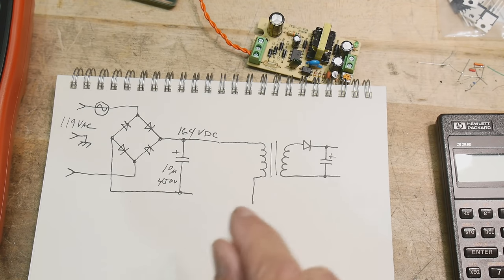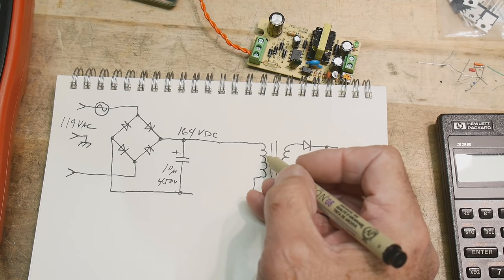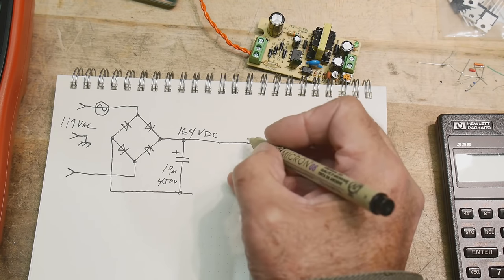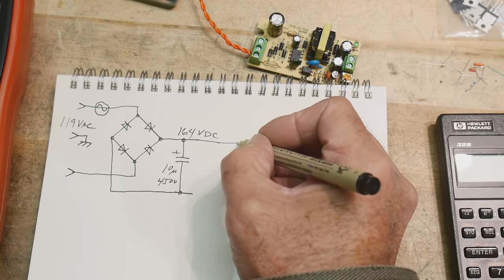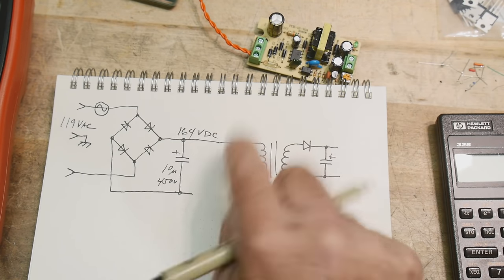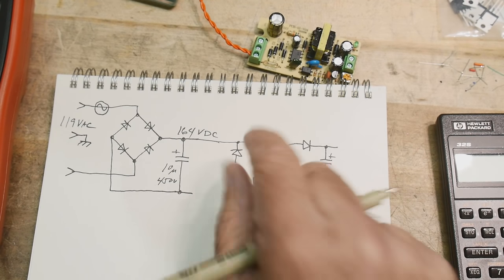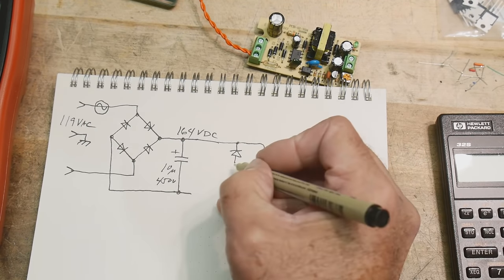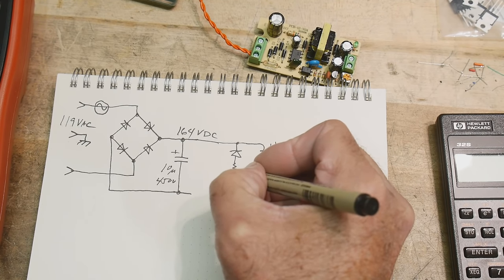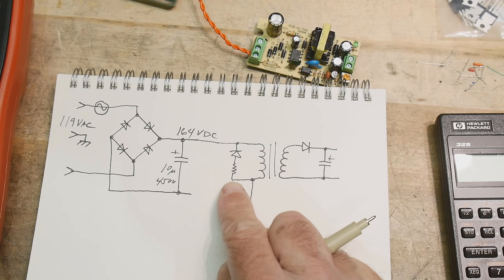And we have to kill that spike. A lot of times you'll see this on motors or on solenoids and relays. Very often you'll have a reverse diode across this winding. Now they do have a diode in there, but they made it a little fancier. They went ahead and put a resistor here too to limit the current. Okay, and so they have that going across there.